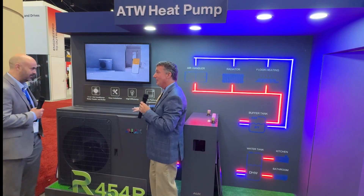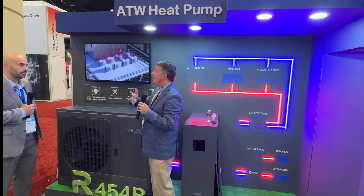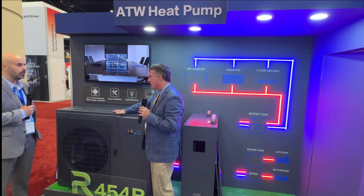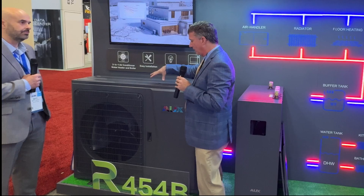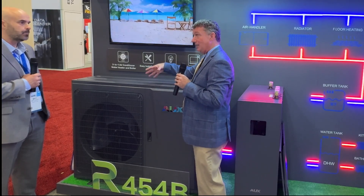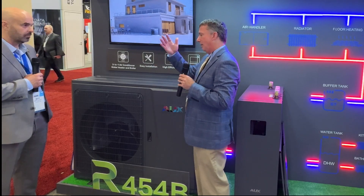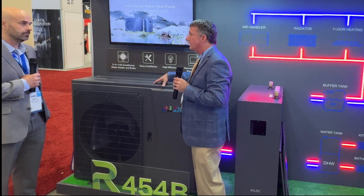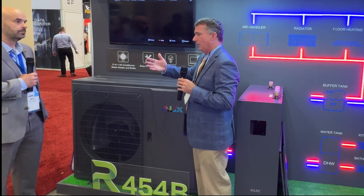I encourage you all to learn more about AUX and what they're bringing to the industry. Now, a lot of people in the industry think I'm crazy about the next generation of equipment, because we're going to have to start using a different mindset. When we talk about the A2L transition — an R454B unit, one of our A2L refrigerants — the reason we've struggled going to A2Ls is because of that mildly flammable component. R32 and R454B — that R32 base is actually half of R410A. We didn't go to R32 because of its flammability in the '90s, so we added R125 on top of it and got R410A. It took all this time to get regulations to bring A2Ls into the environment because we have refrigerant between the outdoor unit and the indoor unit — that was the whole reason for the building code updates.